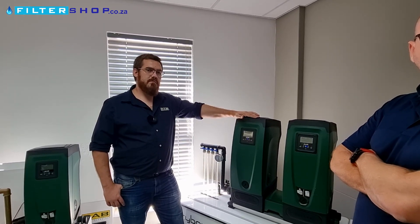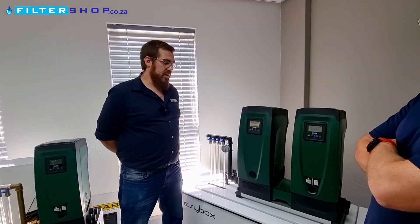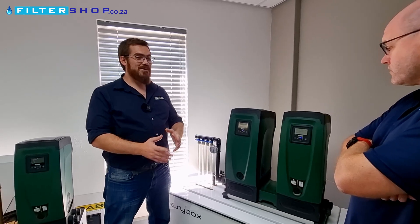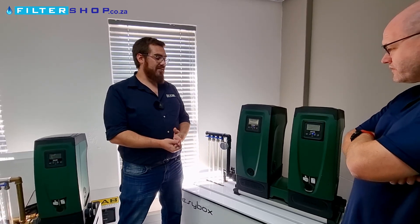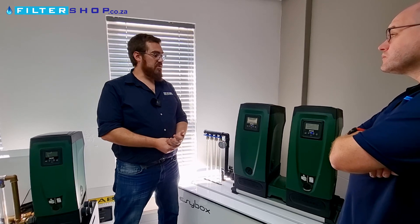If you're pulling eight meters at that altitude you're basically already out of vacuum. It's very dependent on site conditions, pipework, and where you're running the pump. Realistically, from up here, the most I've done from physical experience is between three and four meters.